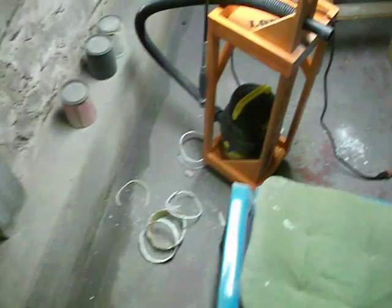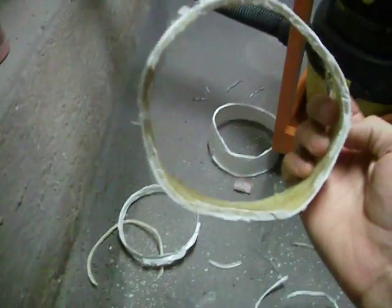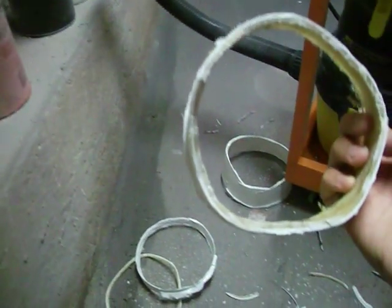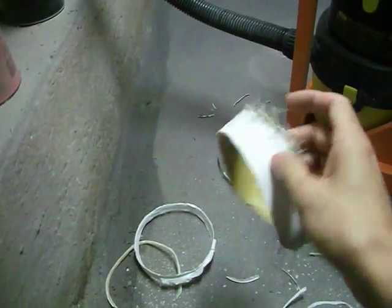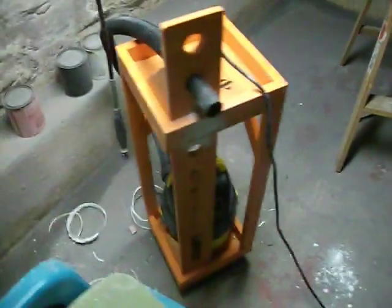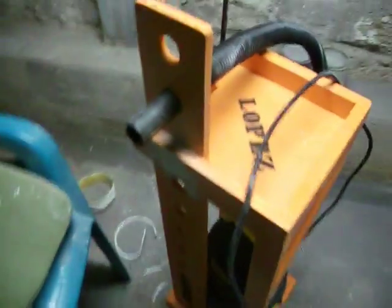Okay, you can see there's some of the necks cut off of helmet casts. This is off the Black Ranger, the fiberglass one. You can see how thick I do the fiberglass and the resin. It's probably a good 1/4 inch thick. So that's really strong. My little shop vac cart that I made so that it can hold the hose there where I need it. My Dremel hanging up right here. So, sanders, that's where I do all the real messy work.